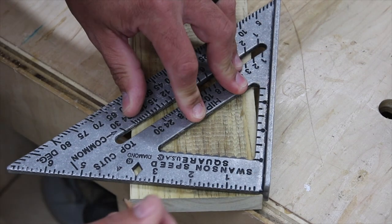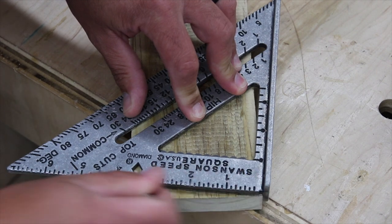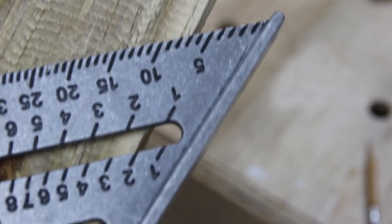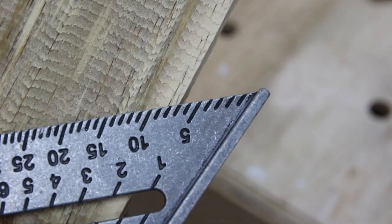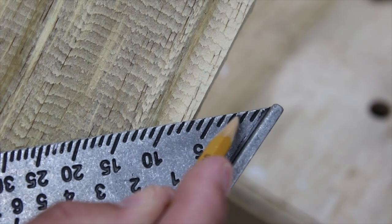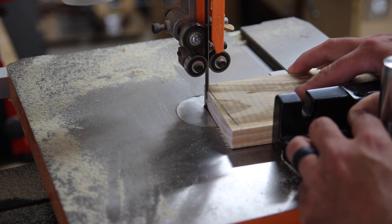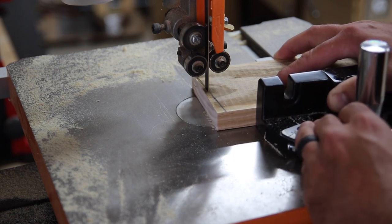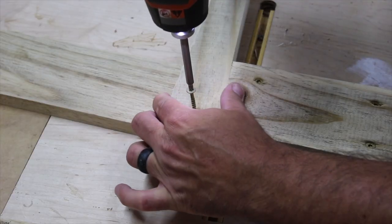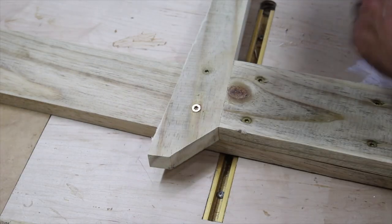The angles also help the legs steady up the chair. I'm using my speed square here to find the angles, and I cover the details on how I went about doing that in the website article linked below. For the cuts on this part of the project, and for most of the project, I opted to use my band saw and miter gauge, though the table saw would definitely be a good option here as well.